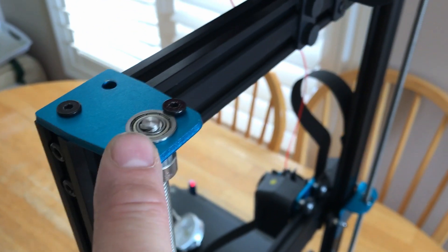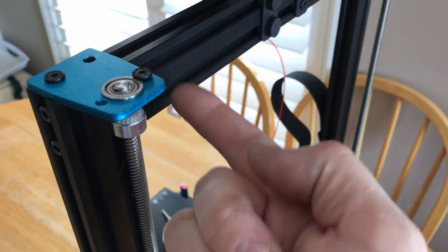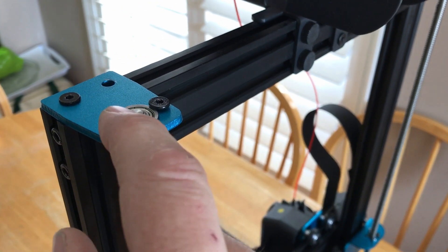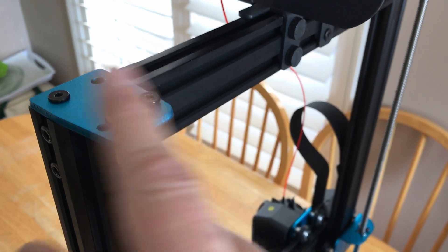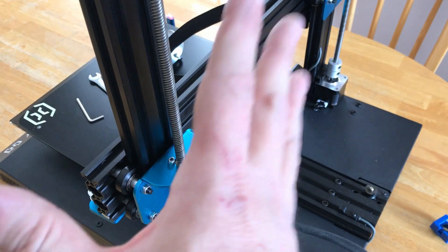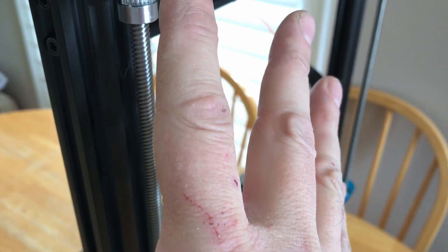At the top, people were taking these bearings off and the belt. I took the belt off — it didn't make any difference. I took the bearings off — it didn't make any difference. So I just took this whole assembly apart and let the rod sit straight all by itself, not attached to anything.